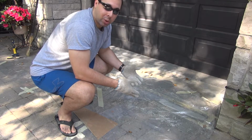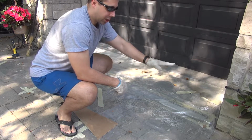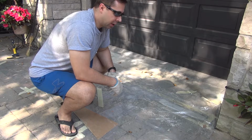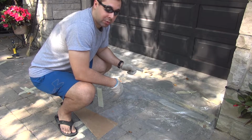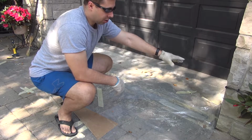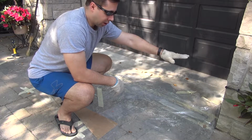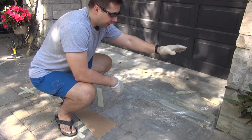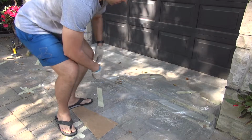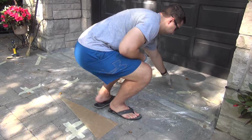And how you do that depends on the mix that you're working with. Regular concrete, quite often recommendations are to spray a light mist of water on top once in a while, periodically. For this one, it's actually not recommended. Fast setting patch concretes, not recommended usually, but what they suggest in those circumstances is to place film on top, just like that, so that the evaporation of water is greatly retarded. So concrete has more time to actually bind this water into itself. So that's that. But let's just take it off and see what we've got here.